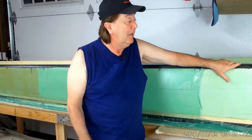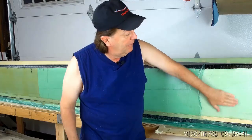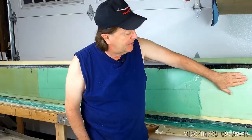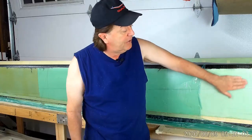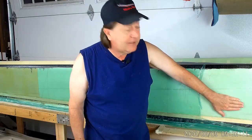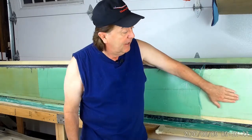I'll provide a link in the description below. I'm going to sand and fill the surface, and it actually saves a little bit of weight because I'm sanding some of the material off. For this one, this surface actually came out better than the panel sample — the smoothness of the surface is superior to that test panel. And it might be a case where I'd just sand the surface. One of my viewers wrote in and said maybe you could just sand it smooth enough without really damaging any of the fabric — maybe there's enough resin there to do that. At first I told them no, that it's not that smooth and I'd have to sand too much, but it might work in this case.